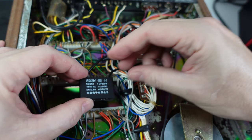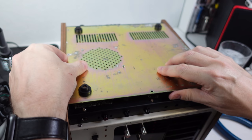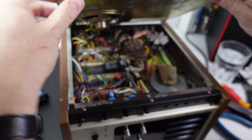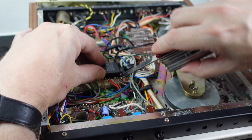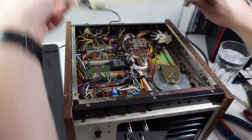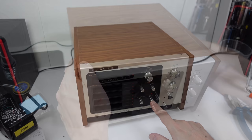Those legs are nice and firm. Now this is either stupidity or confidence, but I'm going to tape this thing down and put the cover on before I test it. I realized that space was where the back of the speaker was supposed to fit - I'd forgotten all about the speaker. I can just lift the capacitor up, move it a centimeter to the right, and then both will fit. Unfortunately, now it's taped down so I need to use my penknife to lever it up. I didn't feel that at all - it was just bridging two contacts, and this was with the device unplugged for a while. So there was something holding a residual charge - no doubt a capacitor. Fortunately, no harm done.